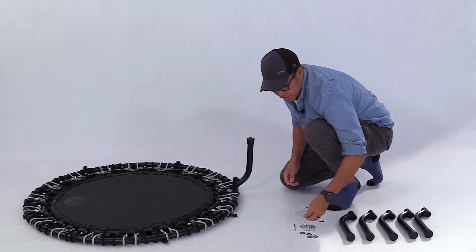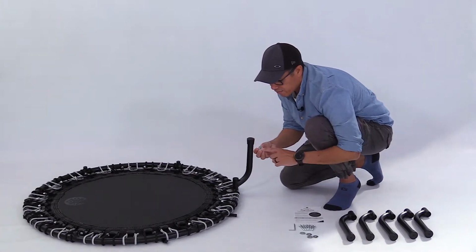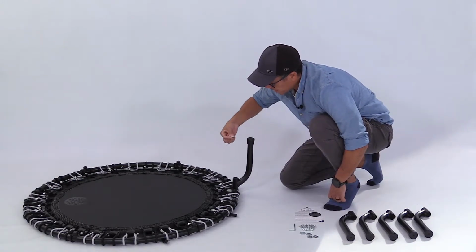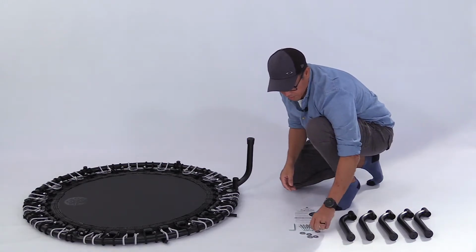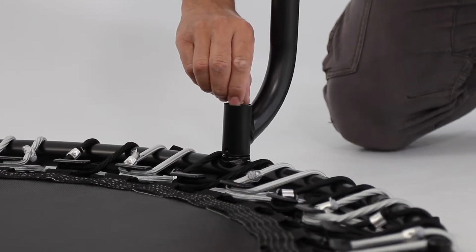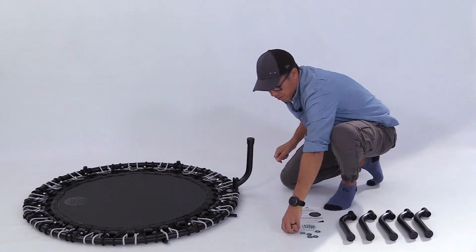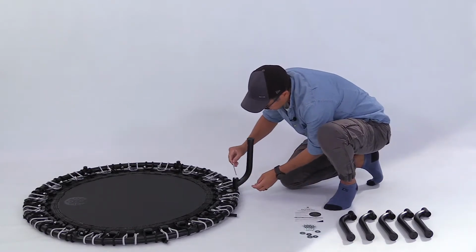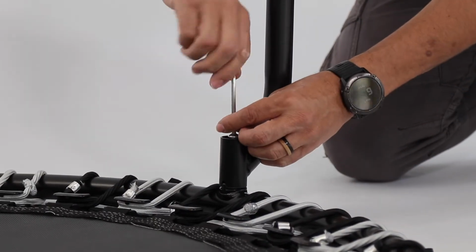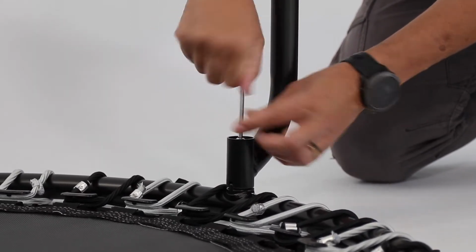What I mean by that, so you'll see when you get the washers, they're kind of silvery, shiny on the one side, and they kind of have a flat matte feel on the other side. You want to drop that in the shiny side, drop it face down into that hole. You take one of your screws, place that in there, and you turn it with your finger until it's a little stiff, and then you take a little Allen key. In the beginning, I suggest you insert it this way because it's just easier to turn, it's quicker, so you're not scratching your leg. So I'm turning it that way.